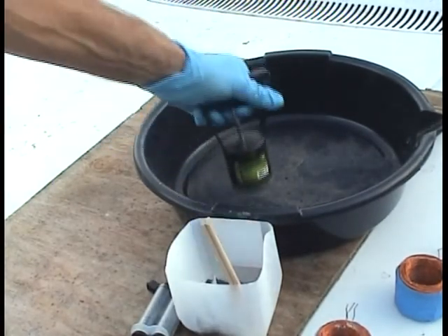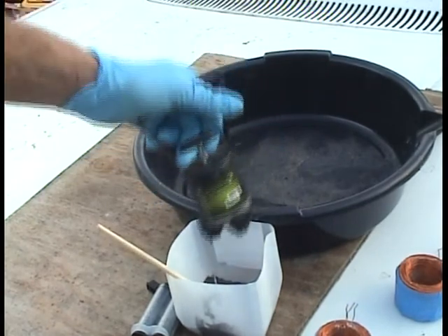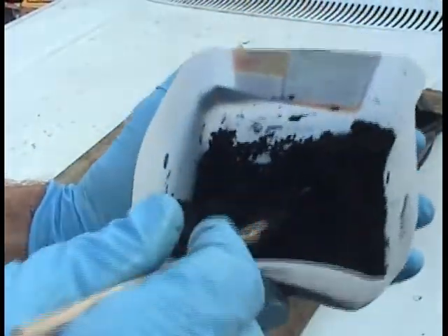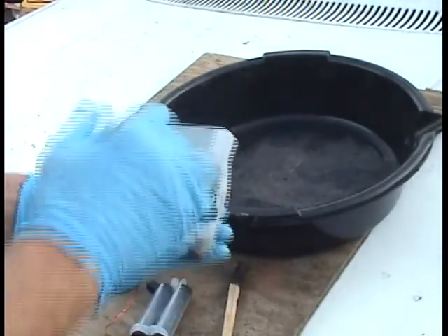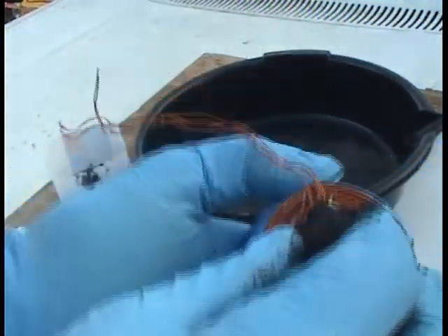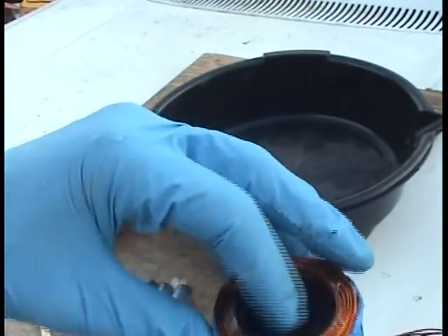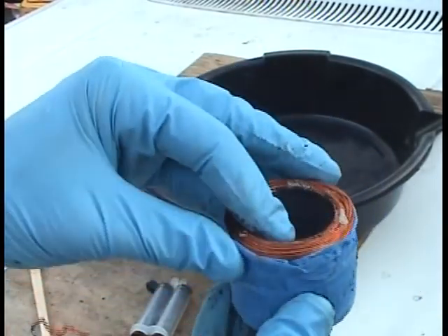Okay, adding the black sand — about that much for now. I put about three more scoops in. Now you can reach in here and scoop it out — kind of use it like clay. You have to do this pretty fast while it's drying. Stuff it in there and push it down really good so it gets in all the air gaps of those winds. That will give you more amps.